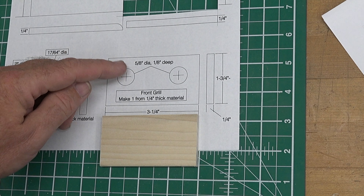Just remember that for the cab sides you need a left and a right — a driver's side and a passenger's side. Now we want to do the front grill. I've cut it to size at the table saw, and I'm just going to scale off the drawing. This is not an imperative measurement, it's just decorative for the headlights. I'll scale off the drawing and drill five-eighths diameter Forstner bit holes, one-eighth of an inch deep, in this piece of poplar for the front grill.